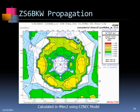What about propagation? There's a free program called 4NEC2 that uses the antenna models and lets you do predictions of propagation patterns under conditions you can set. This is one result for the ZS6BKW. The center shows the antenna lobes, and the colors outside give an idea of signal strength in the field — around 115 corresponds to about S7 or S8, and 103 is around S9. You get higher readings where the lobes are largest. There appears to be a skip zone, and then some additional coverage beyond that. Very little pickup in the close-in area.